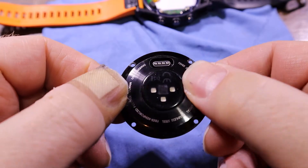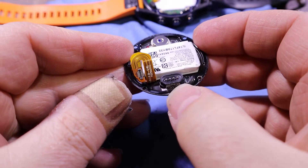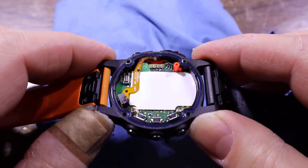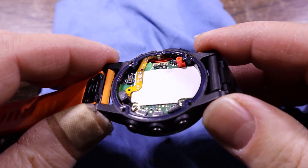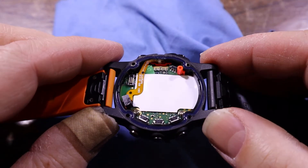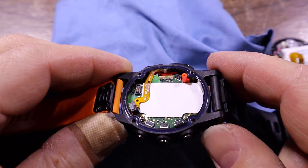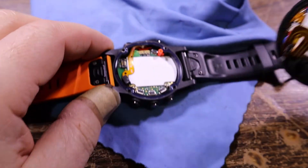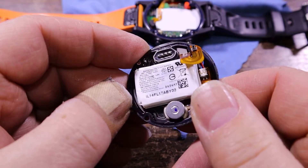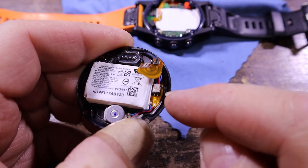There's a fairly commonly used connector, similar to what you'd find in a cell phone. That's the connector on the back for the USB cable - it probably does data transfer as well. You can see it comes through to a couple of little springy pins on this side which make contact with the PCB at the top, and that board manages the charging. Could it be as simple as a bad connection? The battery itself plugs in via a little white connector on the right.